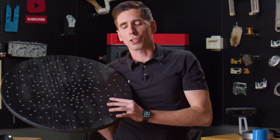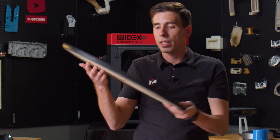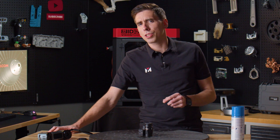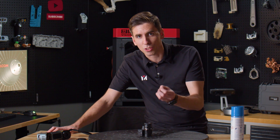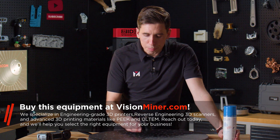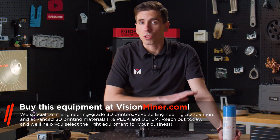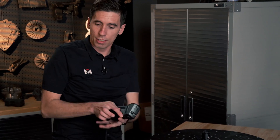Here we have our marker table — really a turntable with a bunch of markers on it, painted black. I can take anything and set it on this surface and scan it without applying markers on the part itself. I may want to in some situations for partial HD scanning to get ultimate high-resolution detail, but for most general reverse engineering scans I won't need to. The scanning spray is great and helps with a plethora of objects — it's thin enough not to affect data capture for reverse engineering. For optics and custom parts, you don't necessarily want to spray them. For 99% of objects it's totally fine — it's inert and sublimates into the atmosphere after a few hours — but with some objects you do want to be careful.